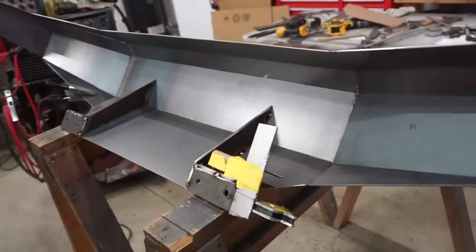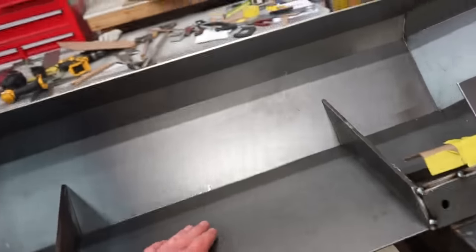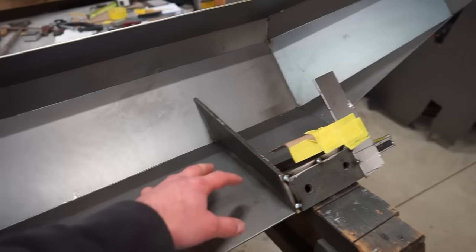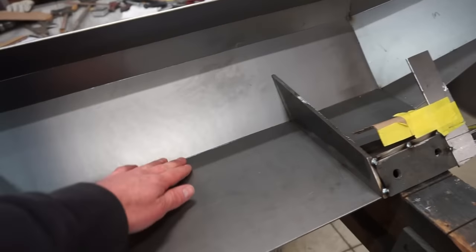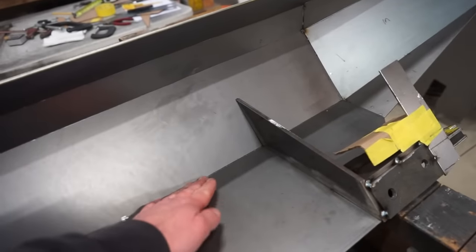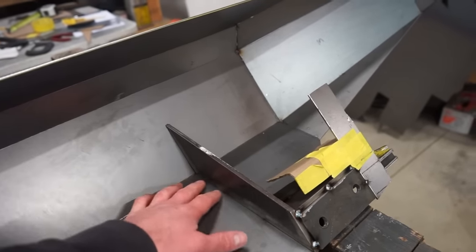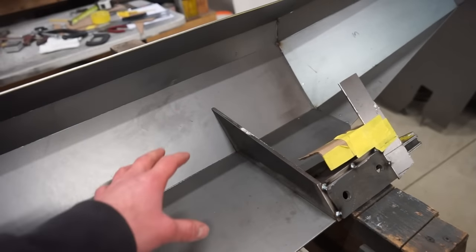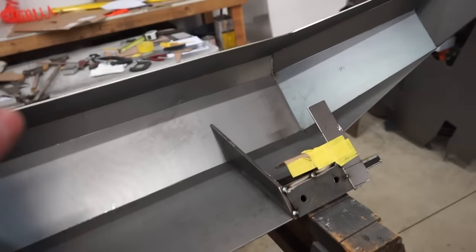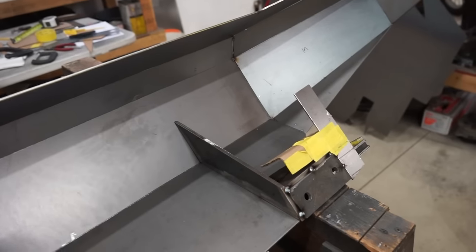So essentially all you need to do to adjust for body lift is move your mount where you need it, and then this angle here you'll have to bend up. So going from 1.5-inch body lift to no body lift at all, this is 50 degrees right here. When you raise this mount up 1.5 inches, this is now 60 degrees. This bracket here is now changed because of the change in this angle here. So I actually will have the plans for the no body lift mounting system, but without actually taking this entire bumper apart and completely rebuilding this bottom section to get it 100% dialed in, there may be small adjustments you have to make, but I feel like I'm getting it really close.